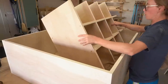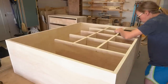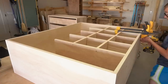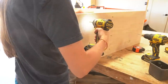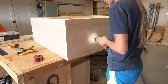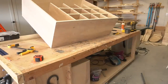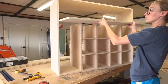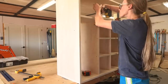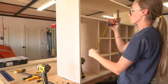Once the main top cabinet was together, I grabbed the shoe cubby piece from earlier and placed it inside. I did make the shoe cubby cabinet about an inch narrower than the overall top cabinet — I honestly just felt like doing that with no logical reason whatsoever. I carefully measured, clamped, and screwed it in place, keeping all of the cubbies perfectly square and flush to the back. Then I added a shelf on top of the cubbies, making sure to keep the opening on the left square and the shelf level side to side. The screws on top of the shelf will be about 7 feet high and covered with clothes, so I puttied and sanded over the holes.